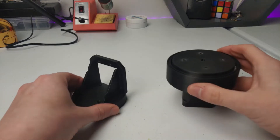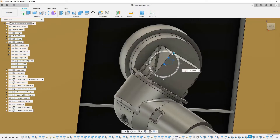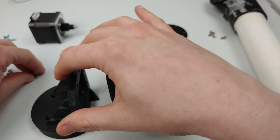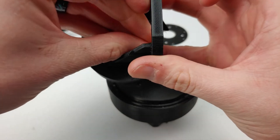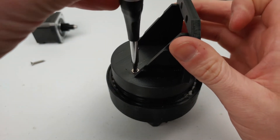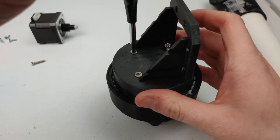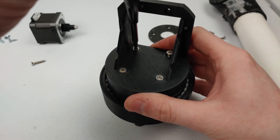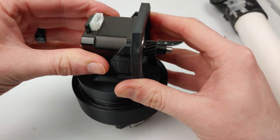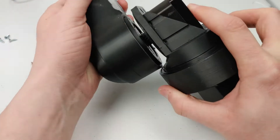To begin, I started a larger gearbox and some mounts to help tie everything together. I started with the shoulder joint because it was the absolute easiest — it had some space limitations, but compared to the elbow and the hand it's cake. This is going to attach the larger actuator to the smaller one via bracket, giving Claptrap's shoulder two degrees of freedom. I attached the bracket to the larger actuator, then partially disassembled the smaller actuator to get to the plate. This plate sandwiches the stepper motor to the bracket, making sure everything is held super tight.